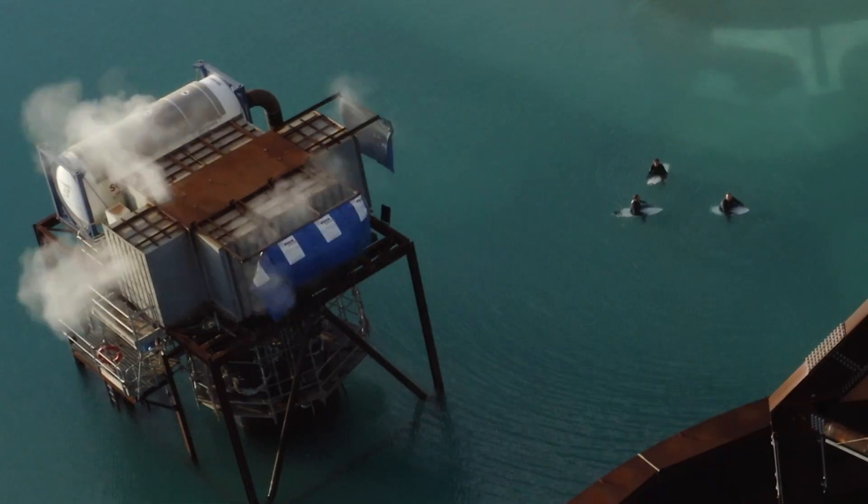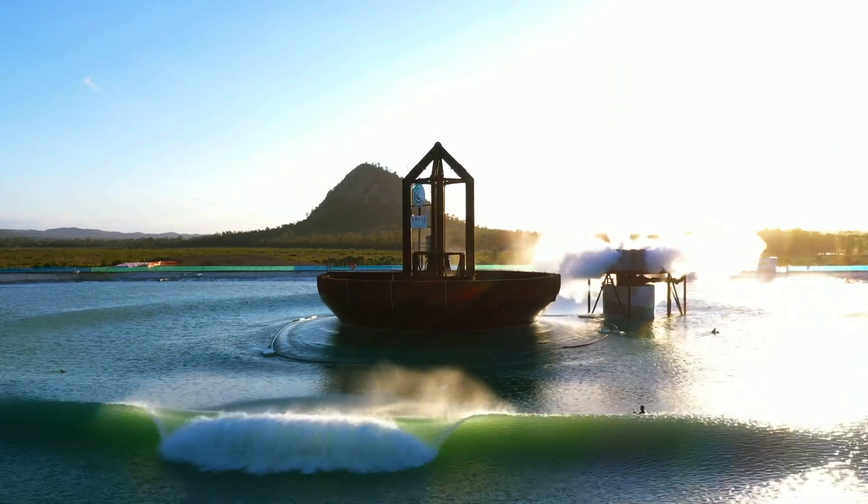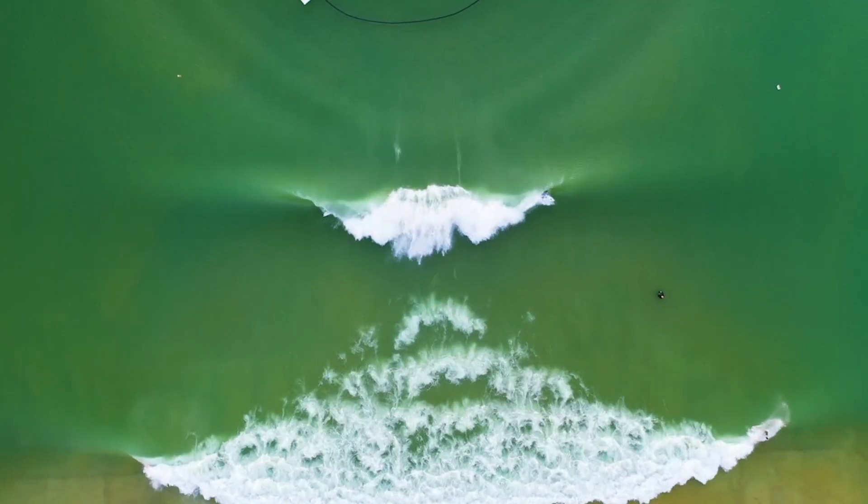With the commercial machine, we duct the water vapor into a chamber which is below the water line of the lake. It is then released from there through attenuators into the air. The good thing about that is that most of the sound is released below the water line of the lake where you can't hear it, and the remaining amount that comes out is very small.